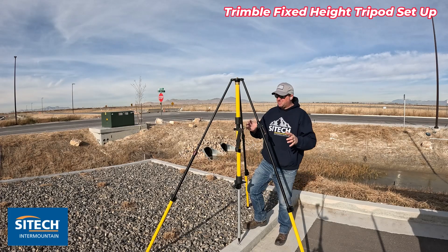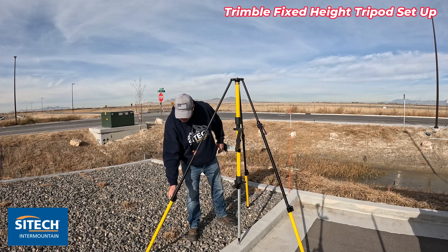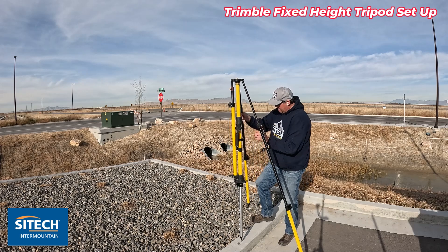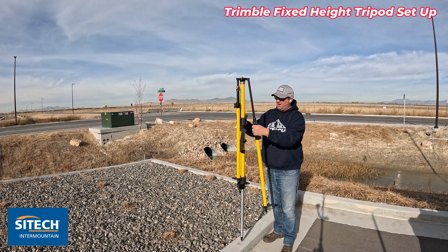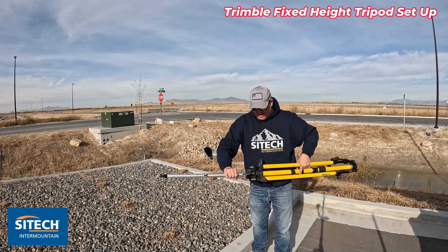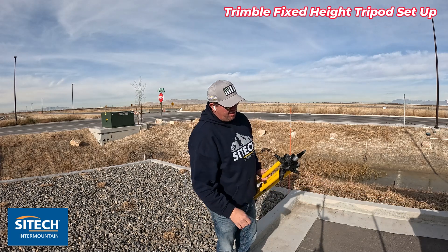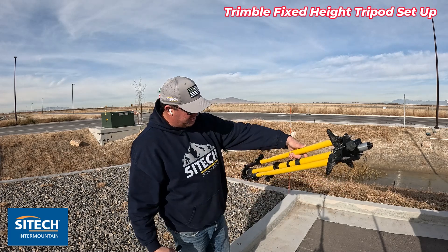One more suggestion when tearing it apart — since it's clunky and you don't want to tip it over and get the level out of play — start with the side that has the two set screws. Loosen both set screws, keep your hand on it, slide this up, put it down into that little pocket, and tighten so they won't come back out. Then on the other side, slide the bottoms up, tighten them all the way in. With your handheld part, pull them up, put them down into those pouches. Then kick it to the side, do everything in reverse: loosen this, slide it out, pop out the little pin, throw the pin back into the pin holder so it's not slapping around, slide it all the way down, and take the point off. Ready to go back in the bag.